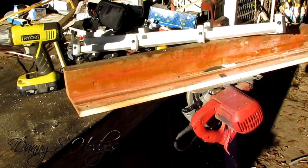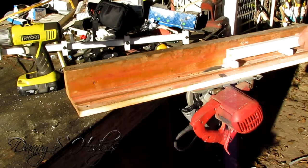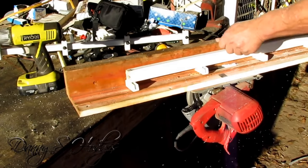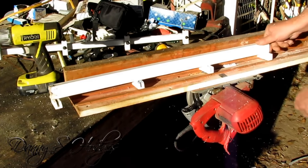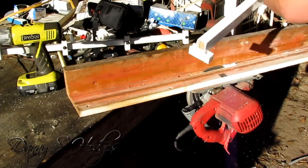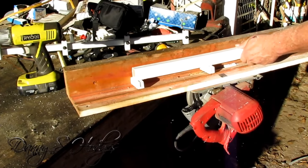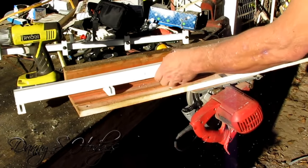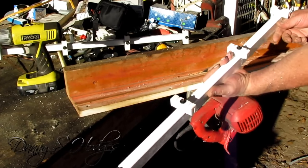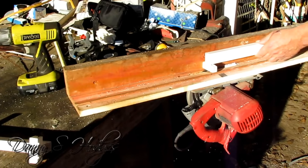I made this thing right here and it's really just real simple. I had an extra saw and the handle was tore up on it, and I got the blade sticking through just the right amount of distance so it won't cut in too far. I took a hammer and bent the blade over so it wobbles when it cuts. I've tried all kinds of things — I've put two saw blades on there before. Nothing works better than that. The blade — it ain't no carbide or anything — it looks like one of them hand saw blades. But it cuts that with no problem.